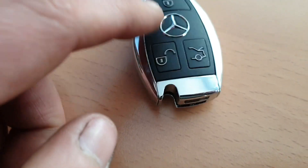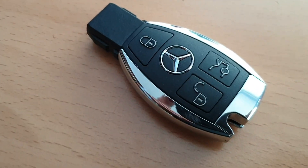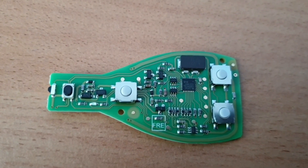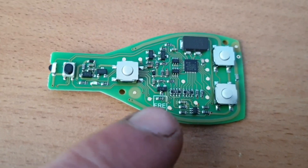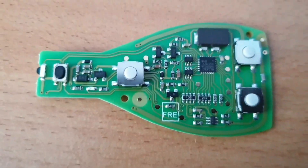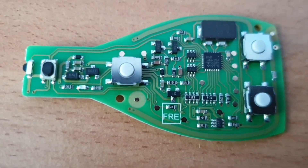It's harder and harder to get them with these in, seemingly. It got delivered wrong — it's 315 MHz, but we're in the UK so we're on 433. All we need to remove is the FRE frequency resistor, that little resistor there. We just need to remove that from the board to make it a 433. I'm going to do that now.